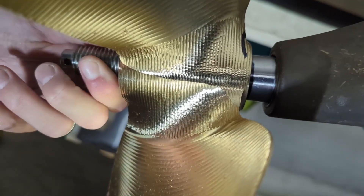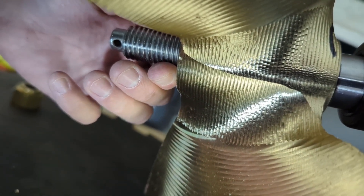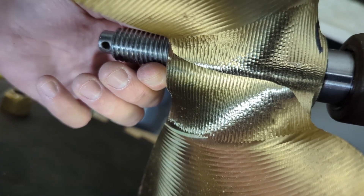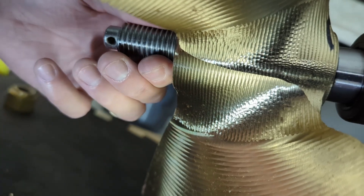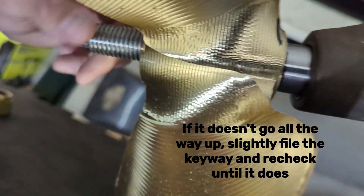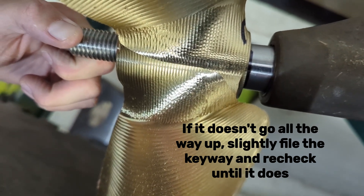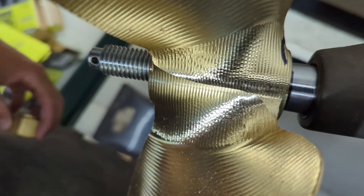That's right up there. That's with the key in. I'll be honest, that's with new hardware — it worked pretty well. If you're reusing keys or a key from a different prop, that's when you might get into issues where the prop won't go up all the way. So I'm happy this prop's up all the way. Good safety check, double check, and now all I have to do is throw the nut on and the cotter pin.